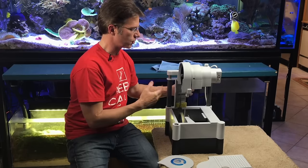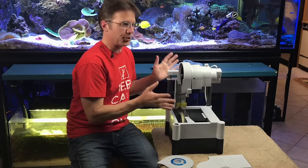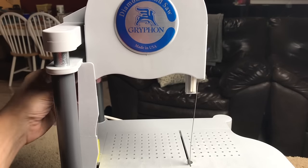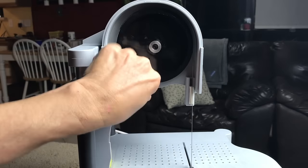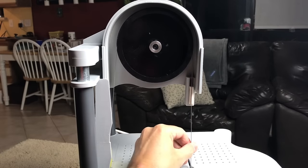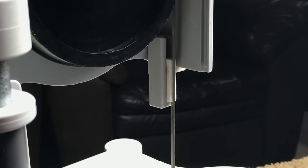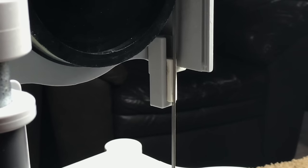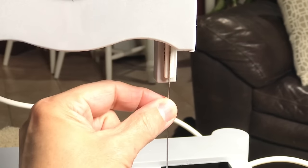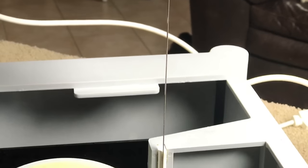Something I discovered putting this together: the motor tilts based on how much you tighten the thumb screw on the back side. If you over-tighten it, the motor will tilt this direction, the pulley will lean this way, and the blade will wander right off. Instead, you want it slightly tilting in the other direction, so resist the urge to over-tighten. Do a test spin, make sure the blade stays in the guides. If the tension isn't set correctly it'll flop all over and possibly damage the blade. Adjust the proper height for proper tension, check at the top and at the bottom before you proceed.